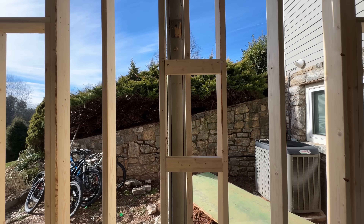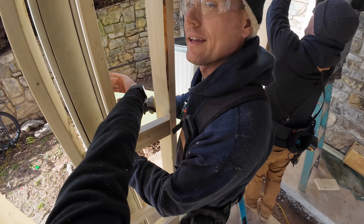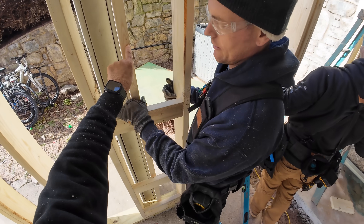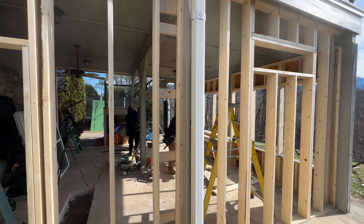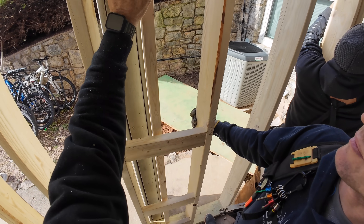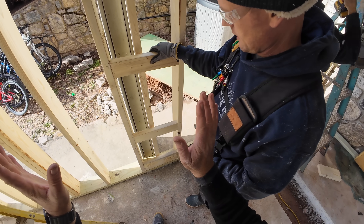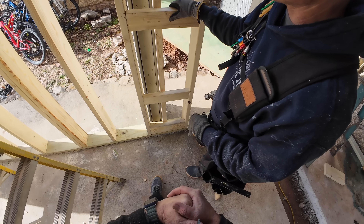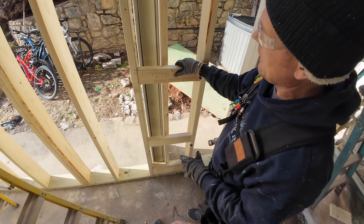Got another interesting spot here with our blocking slash nailers — that's just to catch the sheathing on the outside where this post interrupts it. I did a two-by-four so that I could do this blocking and not have little short teeny pieces of blocking. The hope with all this is that I can insulate in this wall cavity and attach the end of this wall coming this way to that, and have everything have somewhere to nail for the drywall. I've never seen it done like this. That's why I was turning on the camera. But it looks good — it looks like it'll do the right thing. You might want to think about some spray foam in here.